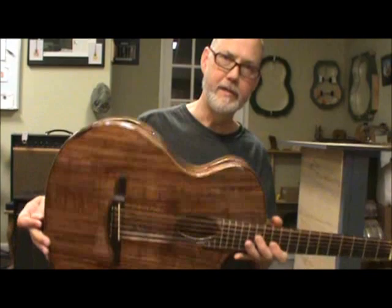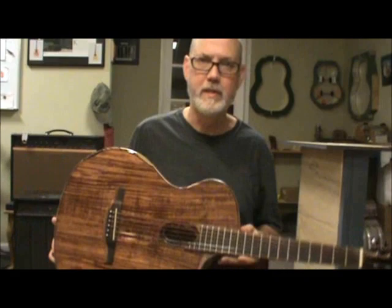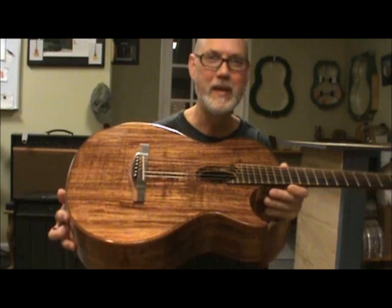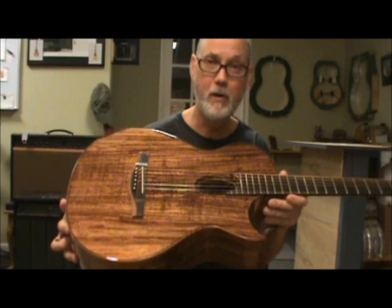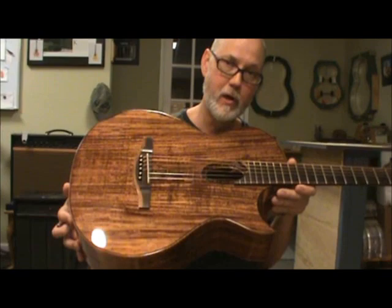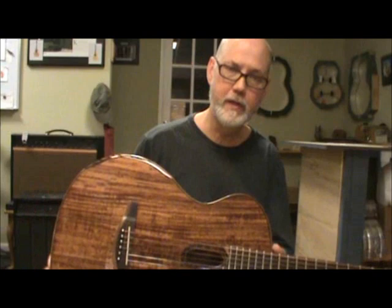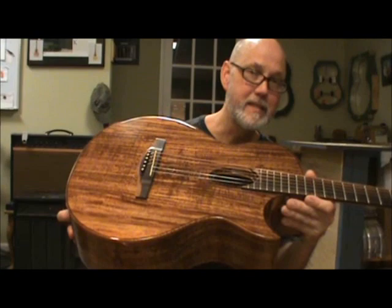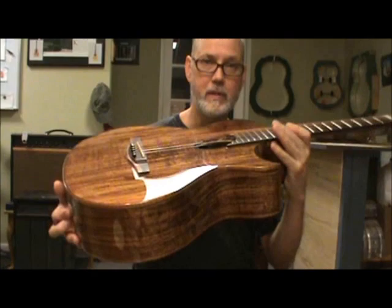They're the Beard-seal style sound ports. I wanted to use a hardwood top on the guitar. I really wanted to use flame koa, but I couldn't find any — there's a large guitar manufacturer in California whose name starts with a T and ends in R who had all the flame koa. What I was finding called high flame was not high flame, but this Australian blackwood is just out of sight. It reminds me of virgin-growth koa you used to get in Hawaii — the dark and tight flames. It's just beautiful. I had used Australian blackwood in the past on guitars for the back and sides and really liked the way it sounded. It's sort of a halfway step between koa and rosewood, and I thought it would make a nice-sounding hardwood top.